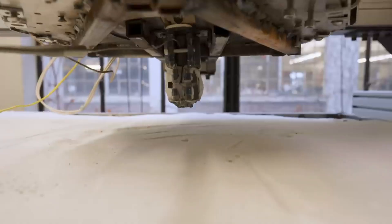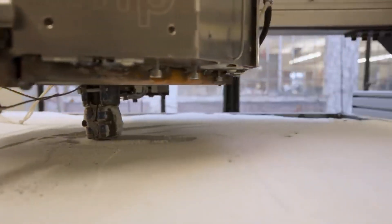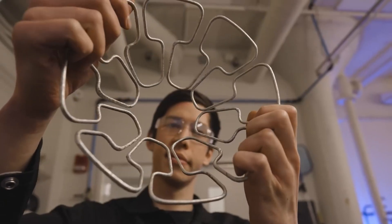As far as the glass beads they use, I thought that was really awesome as well. They can't see what's actually going on as the metal is being pushed through the nozzle and then implanted into those beads, but they can obviously see the results. They experimented with several different materials to fill the print bed, including graphite powders and salt, before deciding on 100 micron glass beads, because those beads can withstand the high temperatures of molten aluminum and act as a neutral suspension so that the metal can cool quickly.